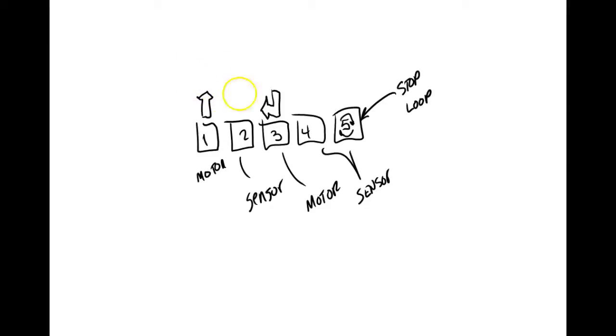By the way, we got these little numbers. Sometimes you got two options when you do your online programming. You got this, which means the motors are going to run unlimited. Or you're going to have a little number up here, like a 5. And that means it's going to run it for 5 revolutions. So 5 would be closed loop. Unlimited would be what? Open loop, which means we'll depend on a sensor. Does that make sense? Everybody okay?